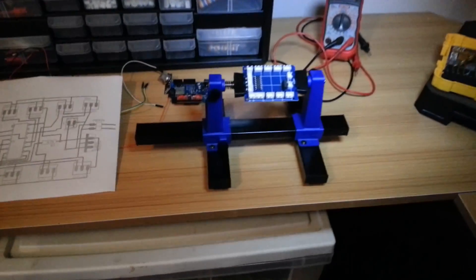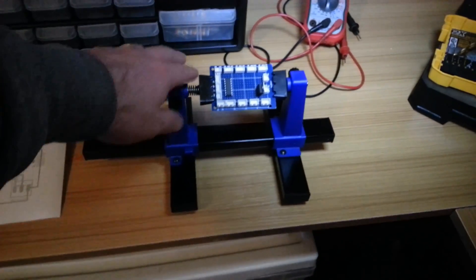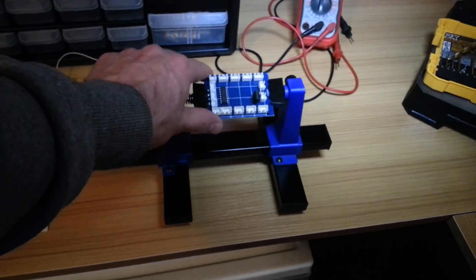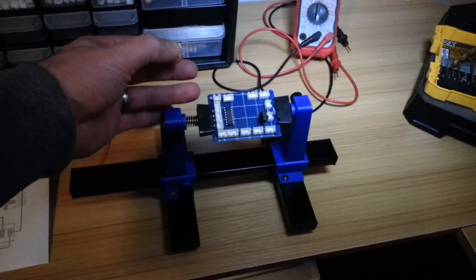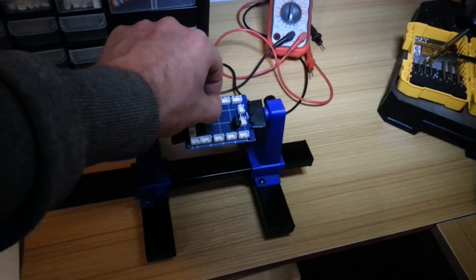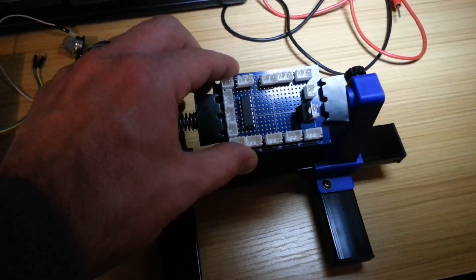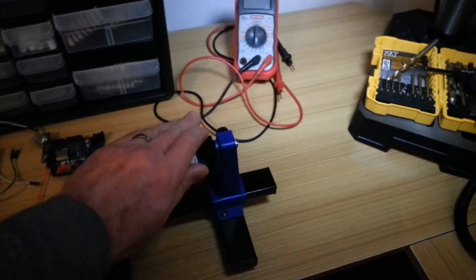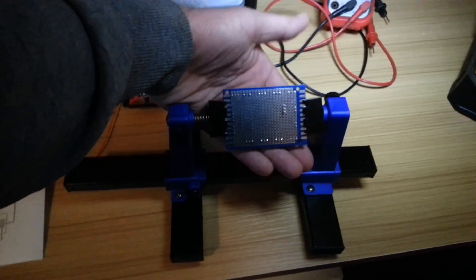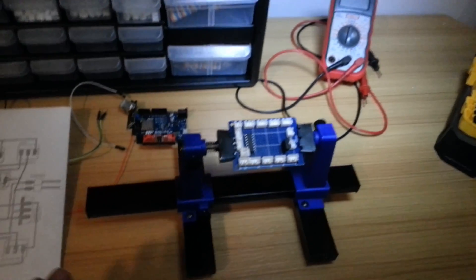Let me show you where I've started. I have my circuit board holder right here and I have my perforated circuit board in there already, and I've already started putting in parts here. You can see they just come in and out really easy. It's just got little holes right there — you just push everything down into those holes, and then we flip it all over and we can solder those things on the back. Right now I'm just doing an initial layout.